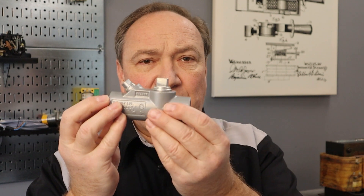For example, a two-inch PVC conduit coming in underneath a mobile home, popping up into the electrical panel. Now notice that it calls for a seal, not a seal-off — that's a different thing. A seal-off is what you'd use to make something explosion proof, and that's not what's required here. Duct seal or electrical sealing putty is approved for this purpose. So you might come up from an outside light switch up to an LB and poke in — you can put some duct seal inside of the LB.